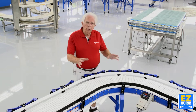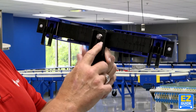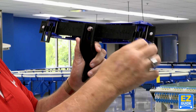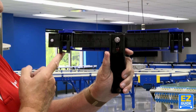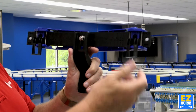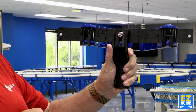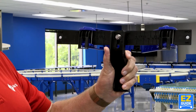Now let's say I only want to move it two inches. I'll show you how this works. This is the backside of the Easy Guide mounting rail bracket. We have a plastic bracket here that bolts on the conveyor, vertical adjustment, and then the horizontal mounting rail. The way this works is, this is the Easy Guide manual lock — you just push this up, lock it, push this up, lock it. No tools. We don't want people running around looking for wrenches. So this operates by hand — you just slide it in, push it together where you want it, lock it in place. That's all there is to it. Simple, saves a lot of setup time, a lot of fooling around, not looking for tools.